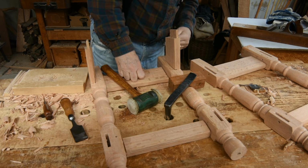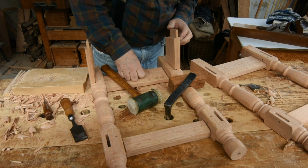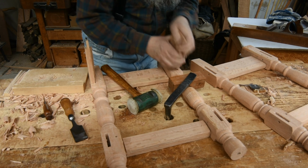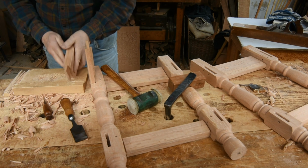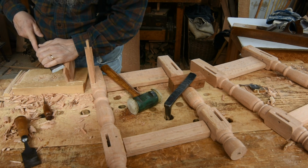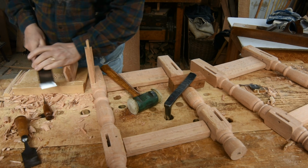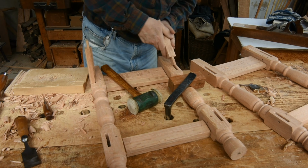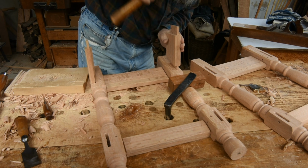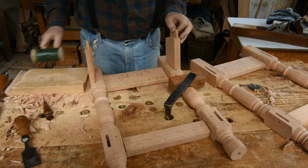So my top edge is a little bit long. It's running higher than the top of the stool, so I'll whack some off the bottom of the tenon. I can go in and fill with the mortise if I want, but it's easier to just take that, move. The bottom edge of the tenon doesn't perform any function in this joint. And that now is where I want it.